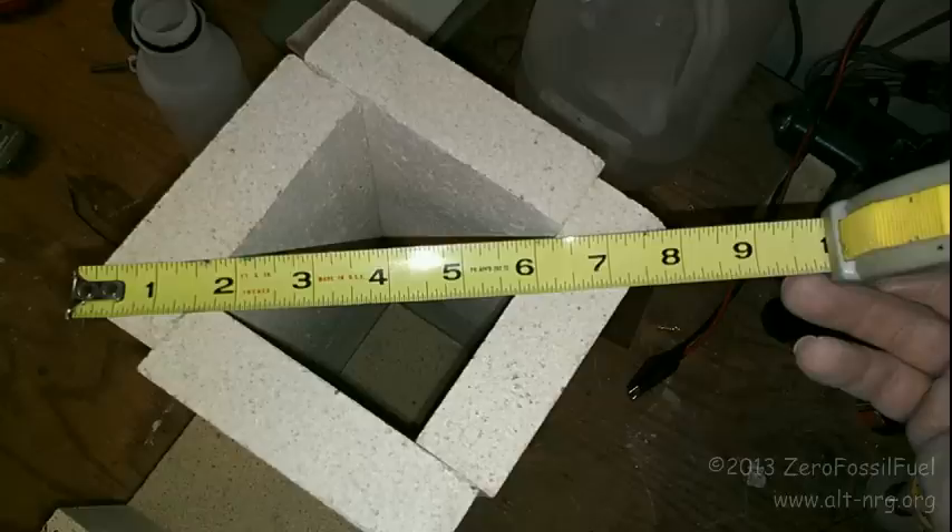One of the dimensions that just happened to work out perfectly — if you'll notice in this picture, I've got my tape measure across the corners of the vertical flue stack that's going inside the 17-gallon drum, and it is exactly eight inches corner to corner. That will fit perfectly inside a round heavy gauge galvanized 8-inch piece of pipe that will not only hold the assembly from rocking around inside the main drum, but I'll also pack in some additional insulation between the gap created around the sides of the fire brick going up the flue stack in the center.